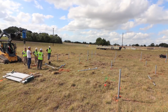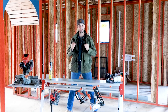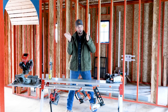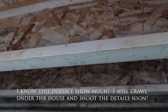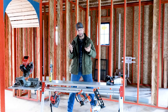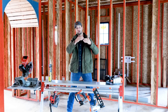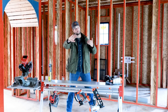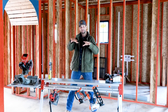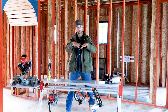Now all we've got are these pipes sticking up out of the ground — we have to build a house on top of that. This is where LP comes in. We used LP's LVL, laminated veneer lumber. These thin veneers are all glued together to make laminated beams. We have some 2-ply, some 3-ply, and some places with 4-ply. Because the helical piles can take so much weight, we could have done very few piles, but as you go further between the piles, you have to support more for your beam and you start getting deflection. So we kept those tight, about 12 feet apart, and put our LVL beams across that structure creating a grid.